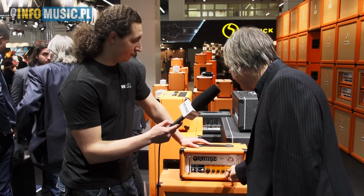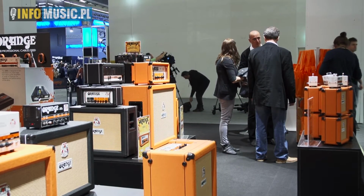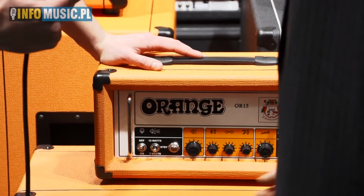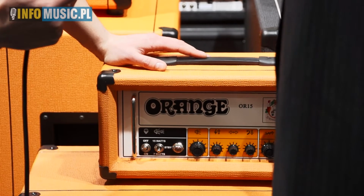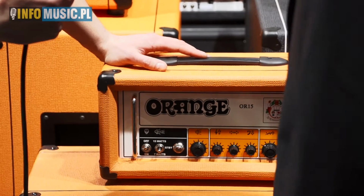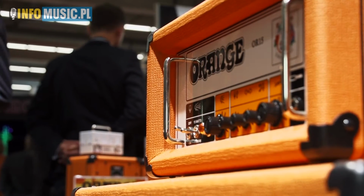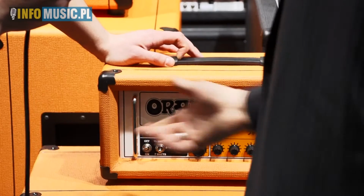And they both clean up if you run the output stage loud and bring the gain in, because the gain is turning up 2 stages simultaneously, or down. So it's 4 stages of gain, the same as that, same effects loop, just voiced more boutique. I did the small 15 watt version this way so that it would appeal to people that don't have the funds to afford the bigger stuff, but still want a classic-looking, vintage-style miniature Orange amp.